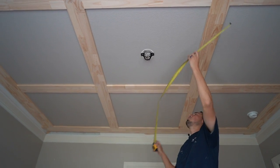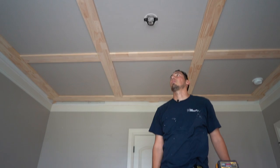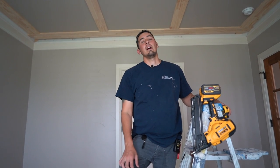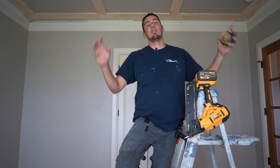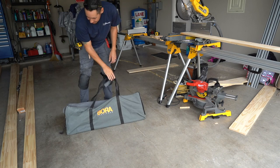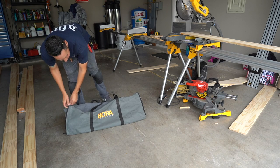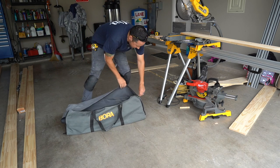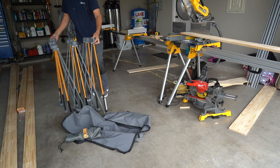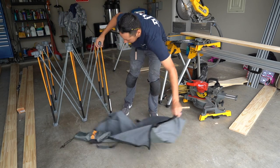We will need to put adhesive on our tempered hardboard, and we're going to do that next. These panels are about 38 by 38, so we'll probably cut them to 37 and 3 quarters by 37 and 3 quarters. They don't need to be exactly perfect because we're going to have panel molding that'll hide that small gap. I've got this new little centipede thing from Bora — a nice little throw-down table — and I'm going to try to use this as a cut station for the track saw.